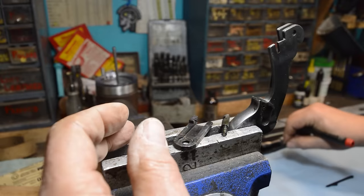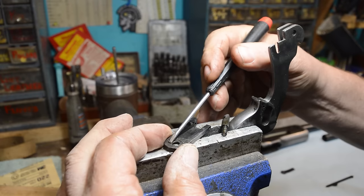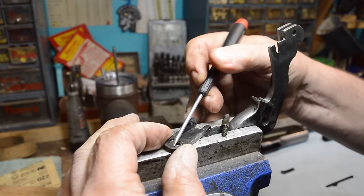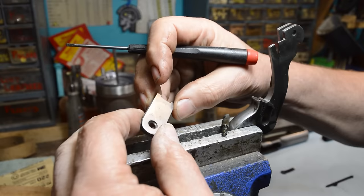So now in the mortise that it was sitting in, you can see right here, there's dirt. Well, that dirt has oil in it. That oil will, by capillary action, wind up on top. It will screw up your bluing job. So whenever you're going to blue a gun like this, you got to be absolutely anal about cleaning it, and there's just no other way to put that. See, it was totally clean on this side, but not clean on that side, right?